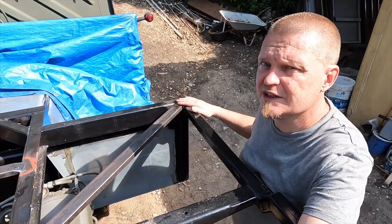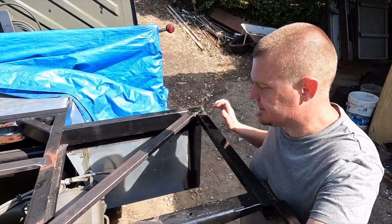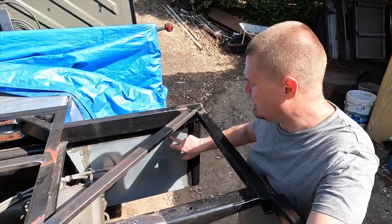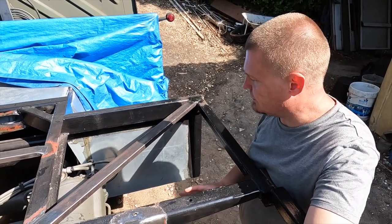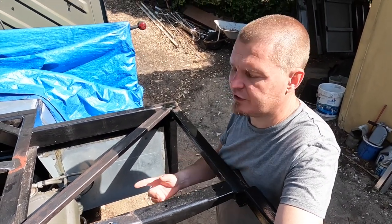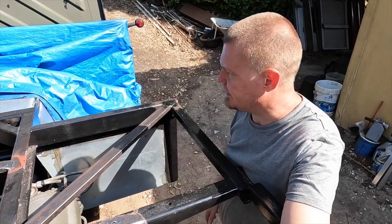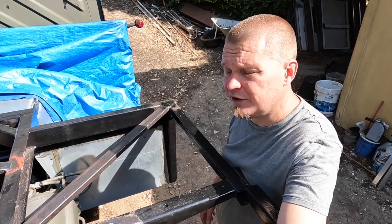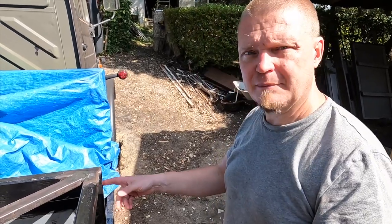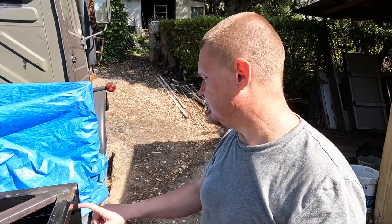I have now removed the evidence of my shonky welding, and the thing that I'd like to do next is that this area here between the recessed step and the rear wheel is the only place where we can have an external locker. So I'd like to prepare for that by making some form of fasteners under here where the floor is going to be, so I don't have to do that when I've welded the floor on. I've also got some uncapped holes here. There's one down there, 40 by 40, and then this one, 40 by 80. So I might as well cap those whilst I'm doing stuff and welding things here.